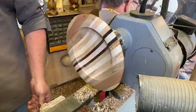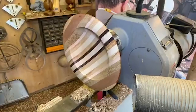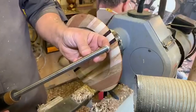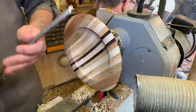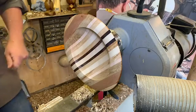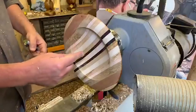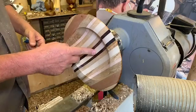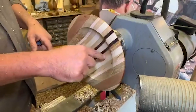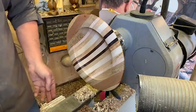On chattering: yes, it can be caused by the depth over the tool rest. You're also going to get chattering and bevel bounce sometimes with a single bevel — so you may have noticed that gouge I was using had a double bevel on it. On the question about turning a bowl edge to centre or centre out with this grain orientation: I will always cut down towards centre point on the finishing cut. Keep making the cut starting in the middle until I'm up to the right diameter, then finish the bottom off — always do it that way with this grain orientation.